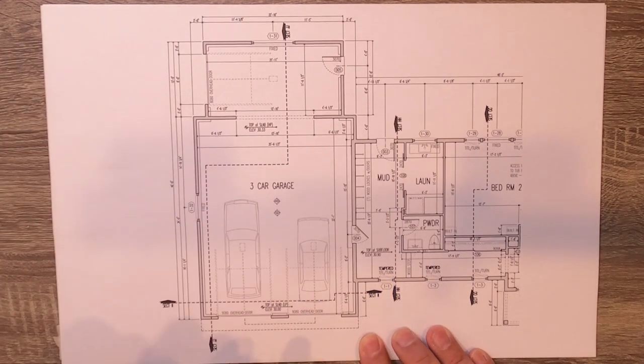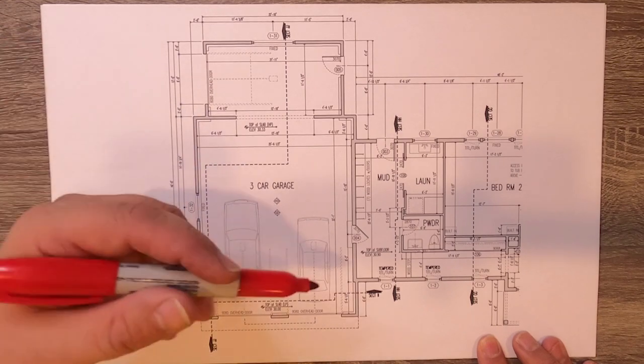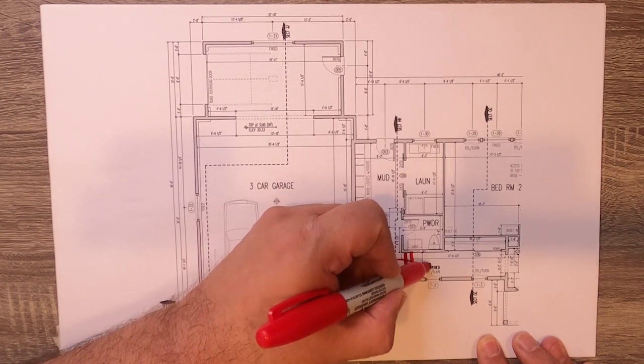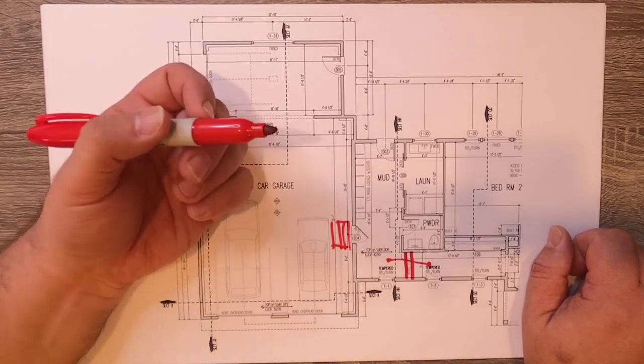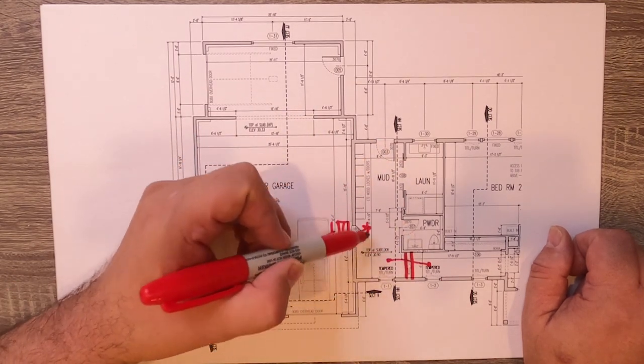Back in the studio now. We just toured the basement and looked at that framing with the 14-inch drop — a little pet peeve of mine. Looking at the floor plan: it's a three-plus car garage with two main bays and a sneaky bay on the back side. Most importantly, those two steps we talked about — the 14-inch delta between the two floor levels — are designed to eliminate a big staircase going from the mud room down to the basement. Just a couple small steps get you up into the mud room.